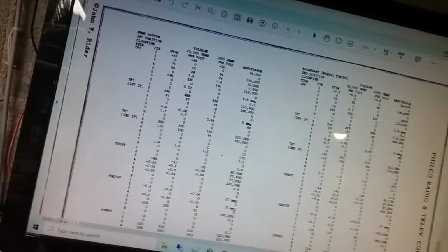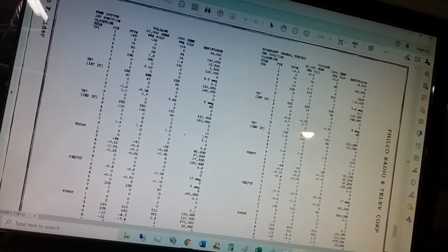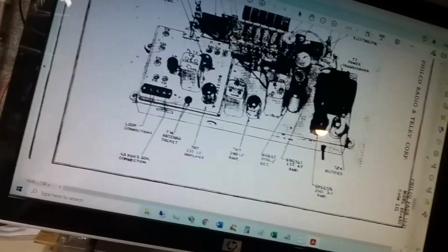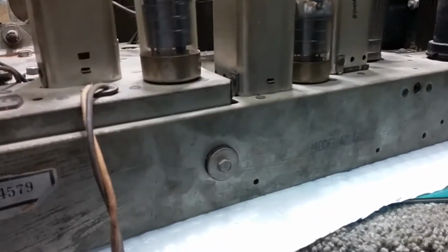And there's the components. What's that? Oh, 20,000 ohms per volt. Yeah, back then voltmeters didn't have a lot of impedance, and so certain voltmeters had more impedance than others. But today the impedance is in the megohm range, so you can use just about any old one.